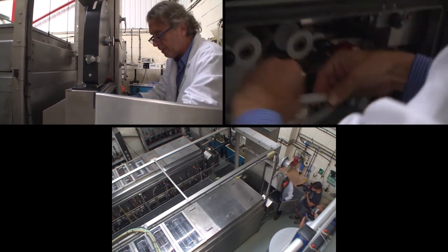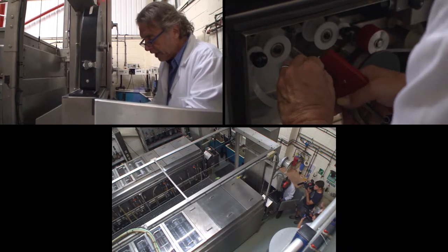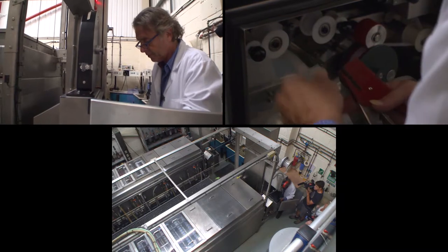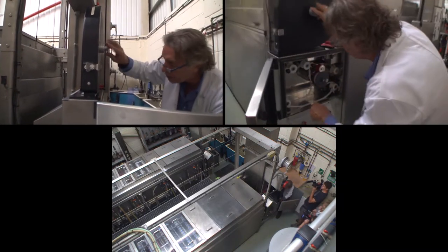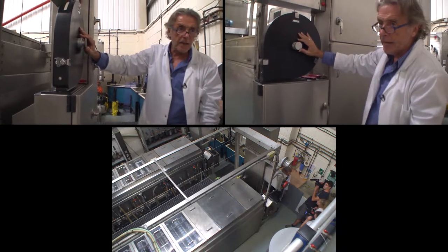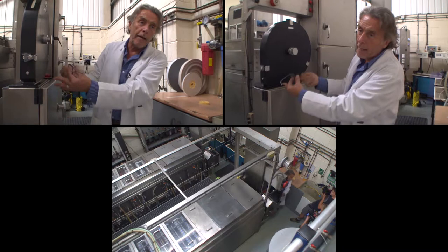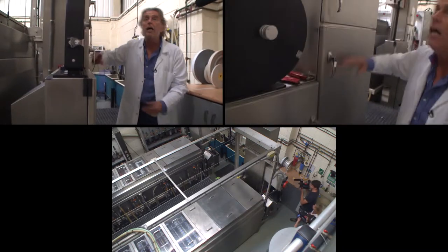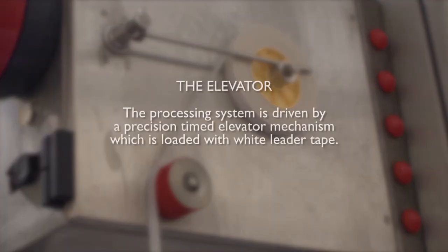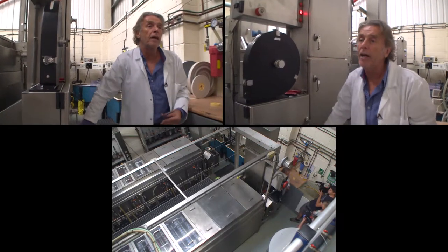There's a finite amount of time to make this change. These lights alert the operator to where the elevator is in here. They're staple joints, which have to be pretty specifically done. We check the lace-up in this light trap, wind the tension back into the magazine, and check the lace-up is absolutely perfect. We release this magazine — it's now feeding into this elevator, which is like a reservoir of film. While no film is being fed in during the change, that elevator is actually rising to feed this machine, which is running at 100 feet a minute. If the elevator gets to the top of the cabinet, you've got a problem — so we never let that happen.